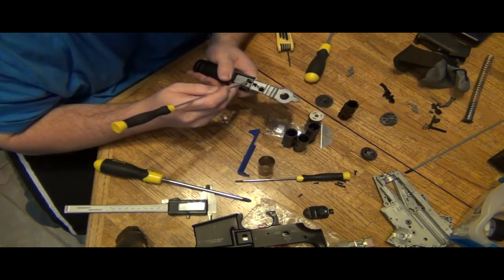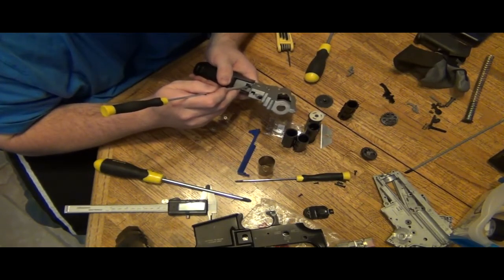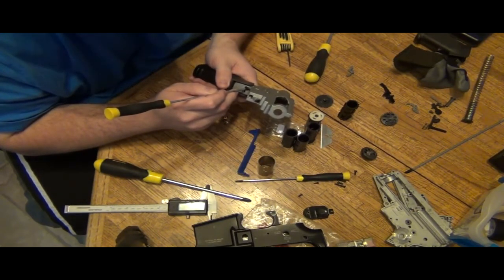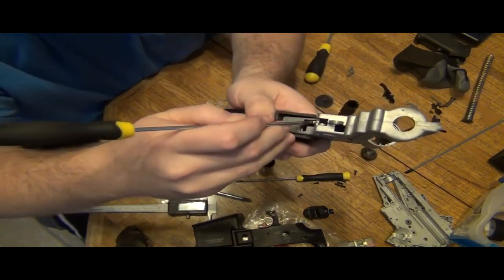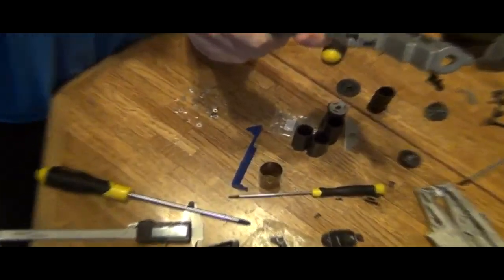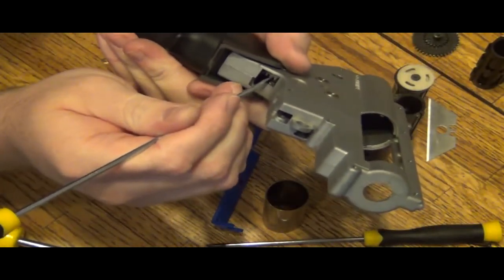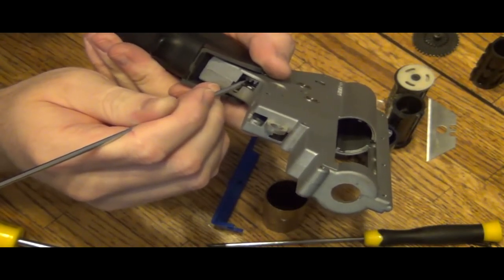And it doesn't move very well. If I put that 0.1 millimeter on top, it doesn't move very well. Now if I hold up the bevel, and I go like this, it moves pretty good. This is the kind of movement we want to mimic. See if I can zoom up here and get that on camera correctly for everyone to see. So I'm holding the bevel gear up, and you can see that's the kind of play we want.